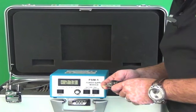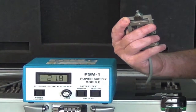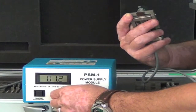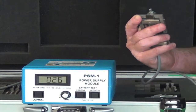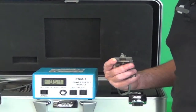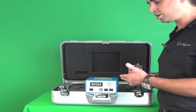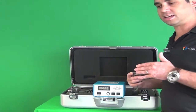The way that we would use this in the field, we would set this up on one side of the diaphragm with the rotor in place, zero it out, and then slide the L-cat through the diaphragm and check the readings at the bottom and the other side of the diaphragm as well. This will let us know the distance between the turbine and the diaphragm and how the diaphragm is aligned to the rotor.